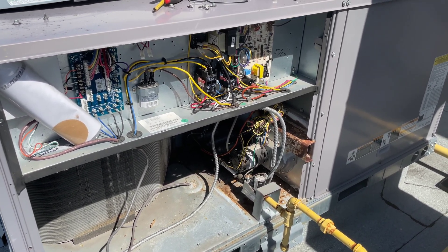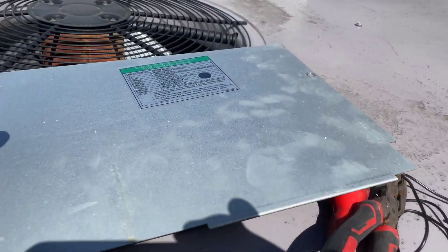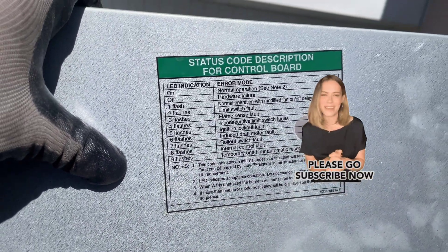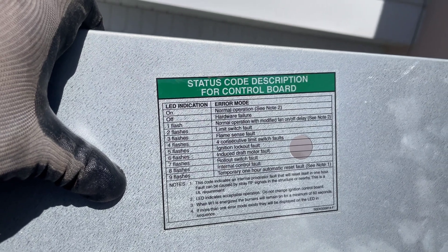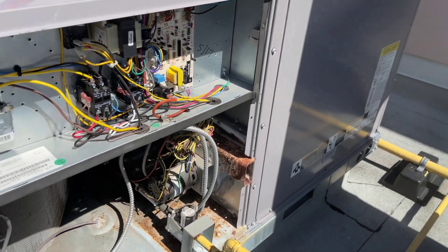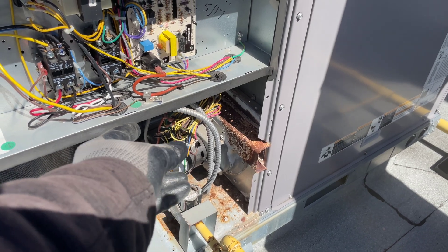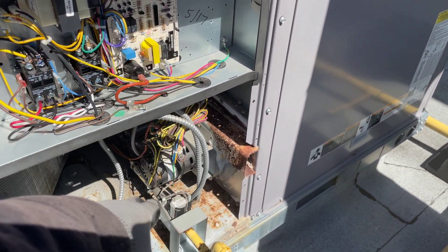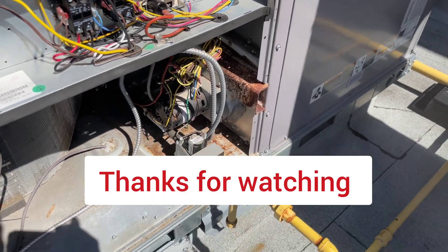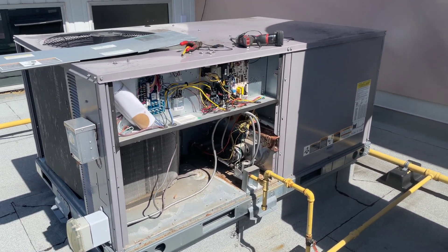Whenever we are doing heating side service and see this fault code, it can relate to a pressure switch. Some Carrier units use a sensor on the back of the inducer motor, like a centrifugal switch connected to the board, and some units use a pressure switch like this one. That was an easy fix because I knew the sequence of operation. See you next time.